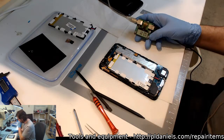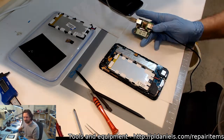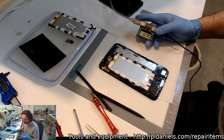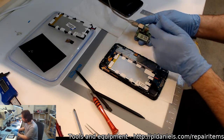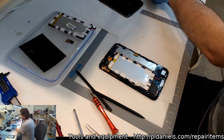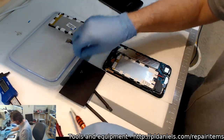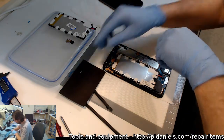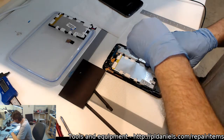The other thing is, I think it's this button or this one, I can't remember. But if you've got an iPhone without a home button and it keeps shutting down and you want to bring it back to life, one trick is to pull the cable out and put it back in. I got sick of doing that, so I just put a button here which detaches the power while you're holding it down, and it simulates having that disconnect without having to physically do it, which saves me a bit of time. Just small things that I run into when I'm working on bits and pieces, and since it's my own design, I can flash it to however I want and change the behavior.